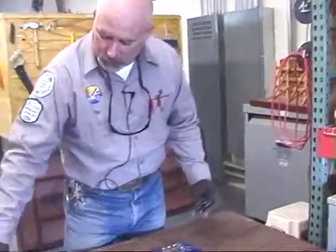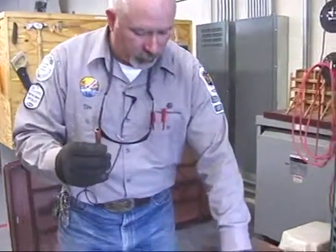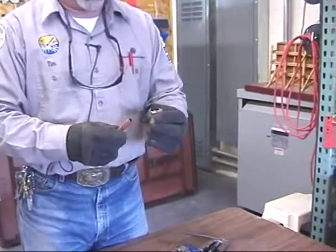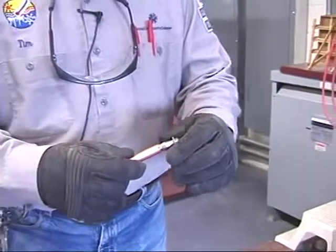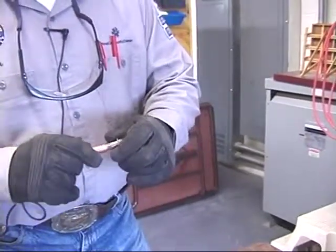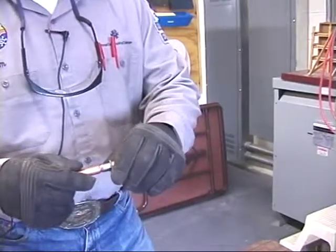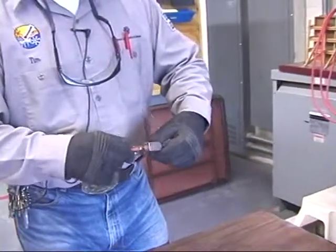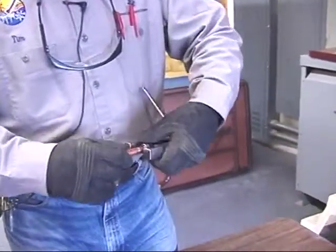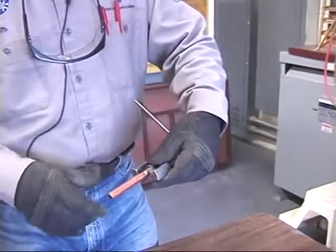You get the yoke, and since you're using half inch tubing, you're going to have to pick the proper swaging tool that's going to open up your copper tubing to the proper size. To check this, it should barely slip into the hole. This is going to fit onto your yoke and you don't have to use any type of tools — just screw it on so it's snugged up in there.